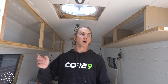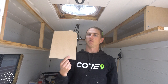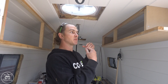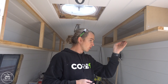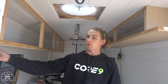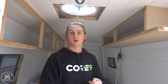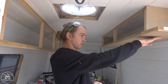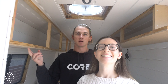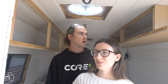What I've done so far is I've built the cabinets, put them in, and then cut out the dividers for both of them. Now I'm just going to zip these off, take them off, and then bog up all the holes. I've also got to remind myself to run a channel out from underneath both of these because we're going to have LED strip lights that are going to sit underneath the wood — you can't see them. After I've bolted it, I'll come back tonight, sand them and give them a paint.